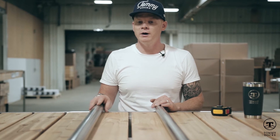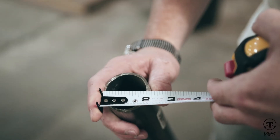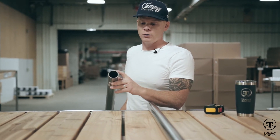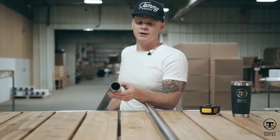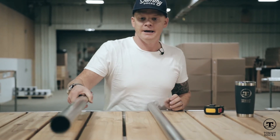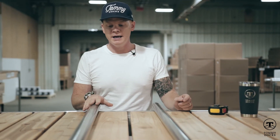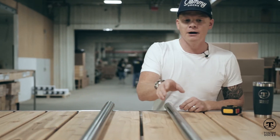The difference in diameter: the heavy duty is an inch-and-a-half pipe — the physical outside dimension is 1.9 inches. The pipe is double galvanized, so you have an interior galvanization as well as the exterior. It's G238 specification, so the tensile strength is extremely strong — a very rigid pipe, as opposed to standard water pipe.